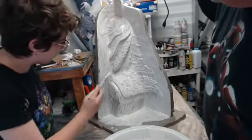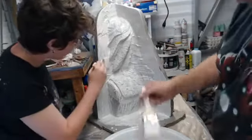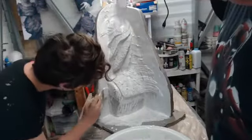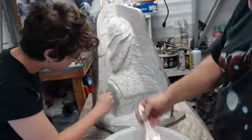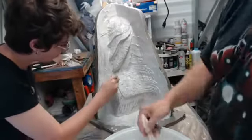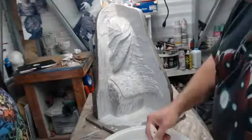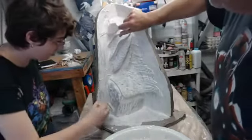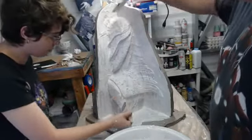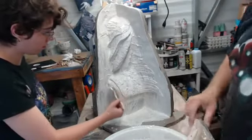90-degree angles of the mold wall. Because if you get a bubble in that area, you're going to have all sorts of problems. It'll fracture along that cutting edge, and then you'll have a wart that you always have to clean out of every casting after that. No fun. And at this point, when I'm putting it on there, I am also doing a little bit of tapping, kind of like the old-fashioned splash coats.